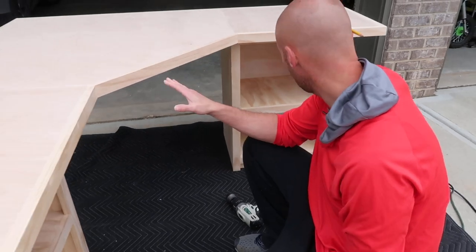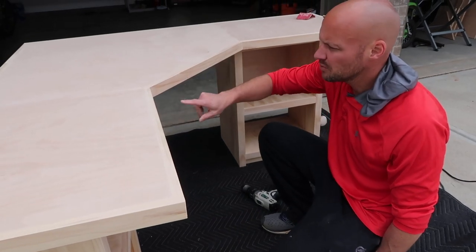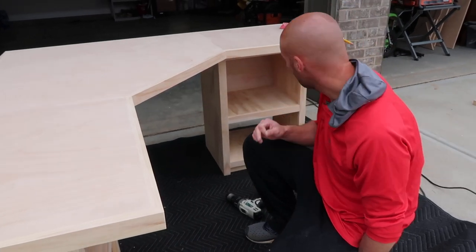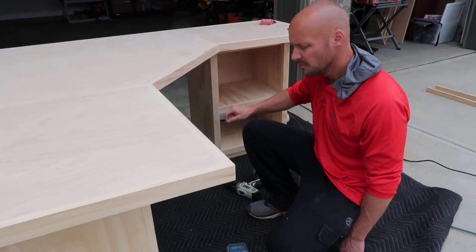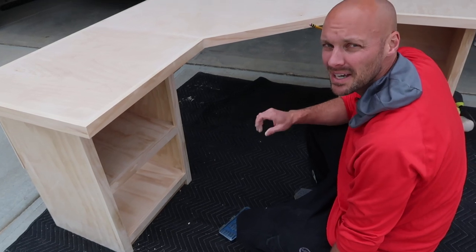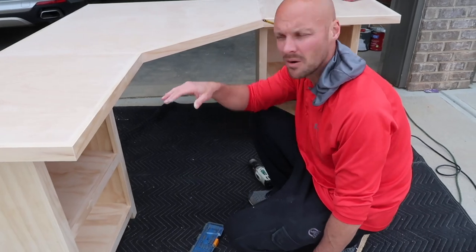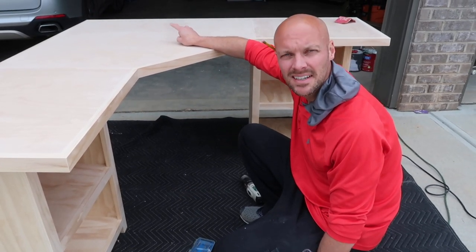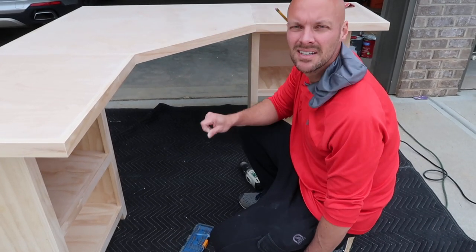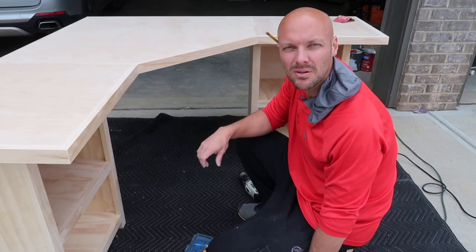Pretty much all the wood has been added to this project and I like how it turned out. Right now we're just finishing some finishing touches — doing some sanding, we've filled in all the little holes, and a couple of nails that need to be pushed in a little bit and filled in. Once we do that we have to prime it and paint it — this is going to be a dark gray when it's all said and done. The last piece is we've got to put some pieces against the wall because this last piece doesn't have a leg on it and it's kind of suspended. So instead of putting a leg on it we're going to put a couple of trim pieces against some of the studs on the wall so the desk sits on top of that. It has good stability but nothing underneath it, so it'll look really nice.